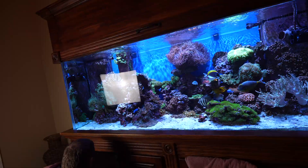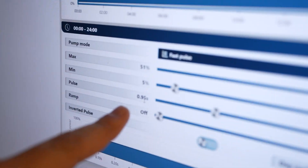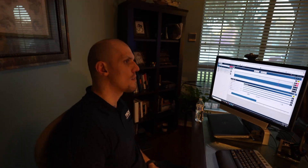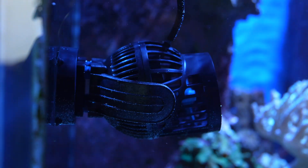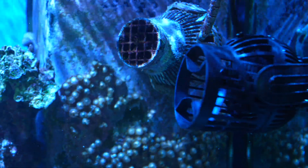After some troubleshooting, we found that at 950 milliseconds we had the best result going between 0 and 100% for a hard wave — but that was actually too much for this tank. So we set it from 5% to around 50%. You can always adjust it, and now we have a nice wave effect without too much flow. Mike mentioned he likes to go into the software and update flows, change intensities — adjustable between calm and strong as needed.